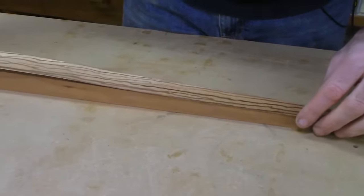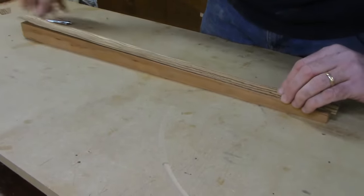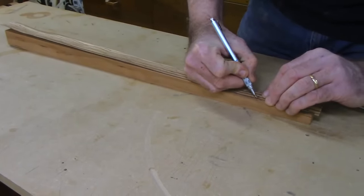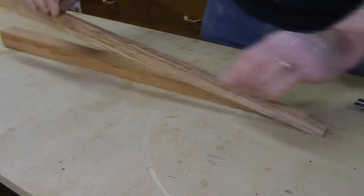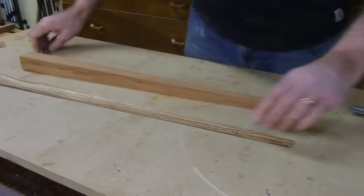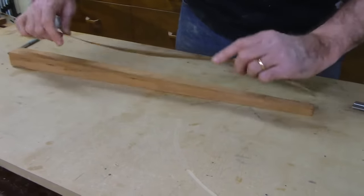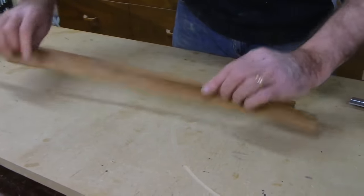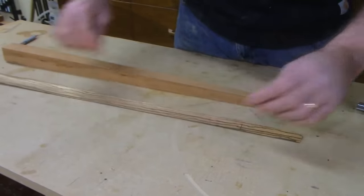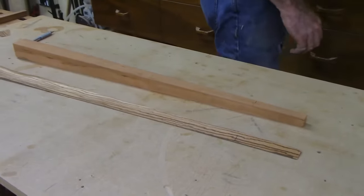I'm going to put some tape on here to hold it in position while I'm ironing on, and then I'll remove the tape as I seal it on there. It's almost like when you use old contact cement with sticks under it, making sure nothing touched until you had it positioned and were ready to pull the sticks off. Here, we're going to make sure it's in position and actually start gluing at this end. We'll be pulling tape off instead of sticks. I could do the leg with glue on the substrate side as well — if you really want to be cautious, you can do both sides, but it works with a single side if you get enough glue on there.